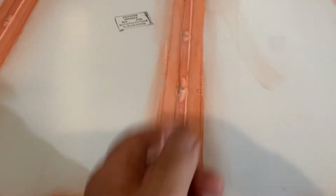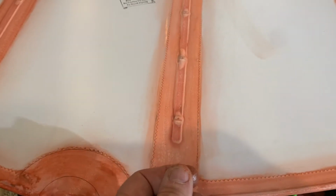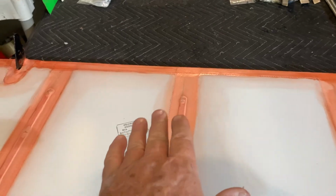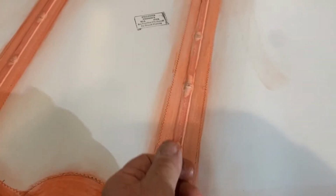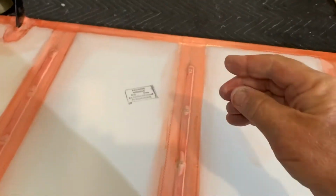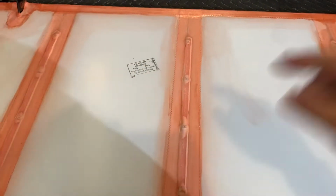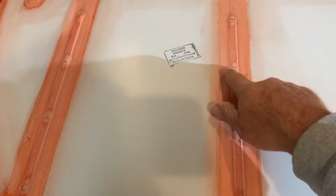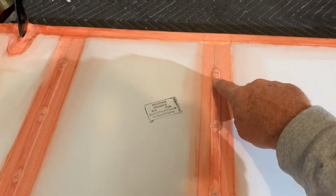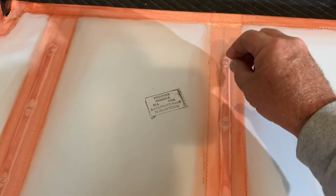And then I just go on, taking one hand, holding the tape there, picking this up so it's not into the poly brush, and I get it where it's nice and straight. Then I just set it down into the poly brush. One thing you don't want to do is try to pull it and make it tight or whatever. In fact, the looser you can let it is the better, because if you look at the video I have out showing you how to poly brush tapes in, where you get the least amount of air bubbles around them, you're going to take the brush very wet. You're going to put a lot of poly brush around the rivet heads, and especially on the ends where it'll pop up. So I puddle it.